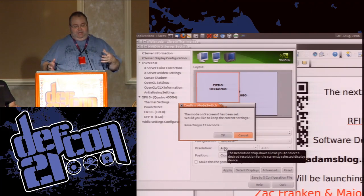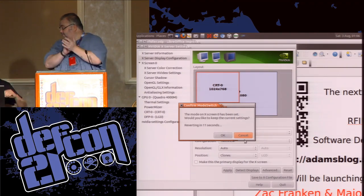Sometimes they're almost spherical. So the question was, does that impact the time to etch? And the answer is yes. Simply, the greater the depth of epoxy, the more time it takes. How do you not go too far on the side? Well, you'll almost never be able to do this and get it right first time round. So expect to go through a few chips until you actually work out, okay, it's going to take X amount of time, and well done.